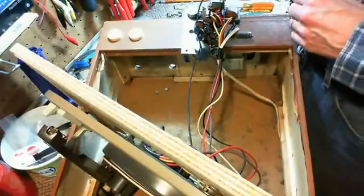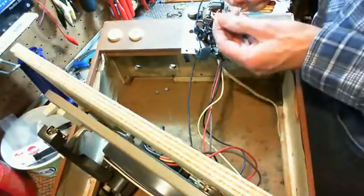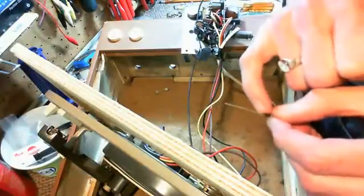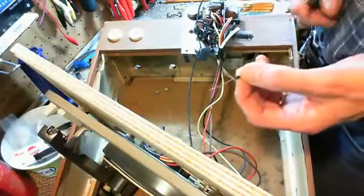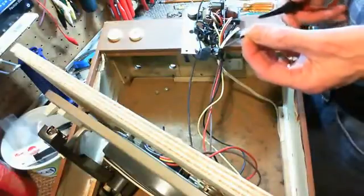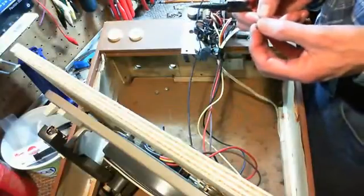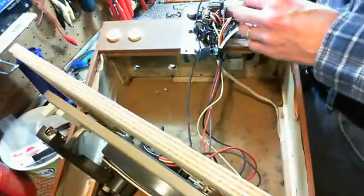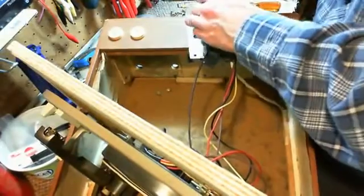It's not like this can be working 19 ways and I have to know all 19. So just refreshing my own memory — the little bar on the end of the diode, you could think of as the bar in the symbol for a diode, which is an arrow with a bar. The arrow points the direction of current flow towards positive. So whatever you want to become positive, you would put the barred end of the diode. And in this case, it would be like this.